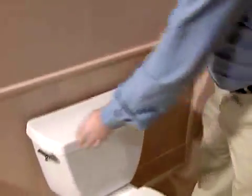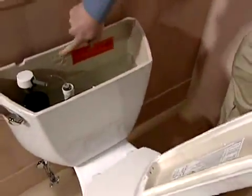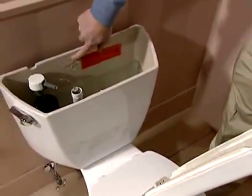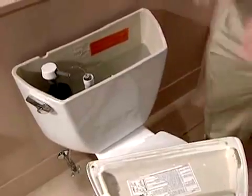The first thing is, you have to figure out how much water your toilet is actually using. That's pretty easy. Go over to the tank lid, pick it up, and look on the inside of the lid, or even stamped in the tank — it may have a gallons per use figure. Or in this case, I have it written right on the bowl. It says I'm using about 3.5 gallons of water per flush. So I know it's wasting water. But if you're not sure, here's how to figure out the exact amount.